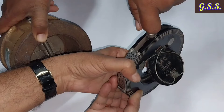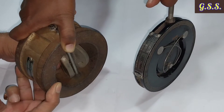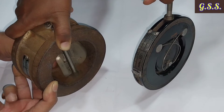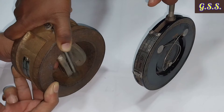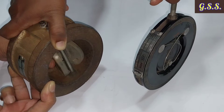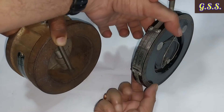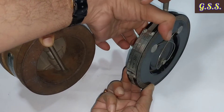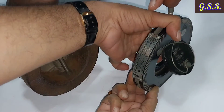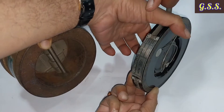In the case of the dual plate check valve, the flap opens in a horizontal plane, so only spring action is there — no gravity action, and we do not have to lift the flaps against gravity. In the case of the single flap check valve, both spring action and gravity action are present, meaning the flap must be raised against gravity and against spring force.